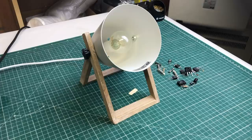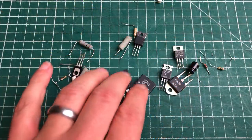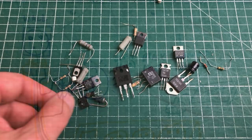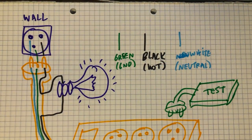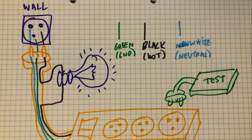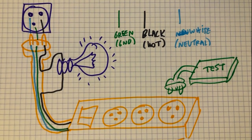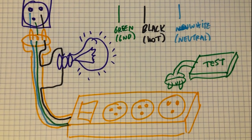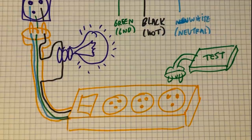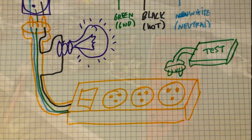After checking and testing all these components we still ended up with a blown fuse. Then I had an epiphany: instead of enduring explosions and a graveyard of electronic components, I decided I would create a light bulb current limiter circuit — putting a light bulb in series with the power supply so that in case of a short, the bulb simply absorbs all the current and lights up, saving components and avoiding violent fuse pops.